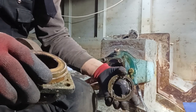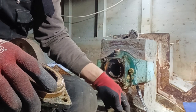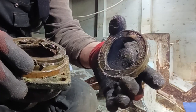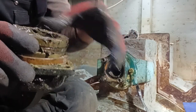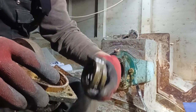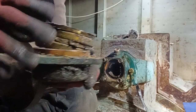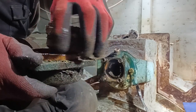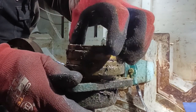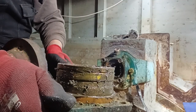And then what happens then, we've got a spacing ring. Second seal goes on behind to create a gap like that, and then that obviously goes in there, and there's another spacing ring going on the top. So that's how your stern gland's built. And it looks like that when it's disassembled. So what we could do, we could take all these to pieces and get new seals ordered, because they're shot. So yeah, that's your stern gland.